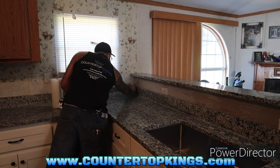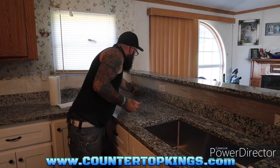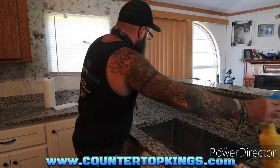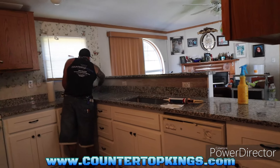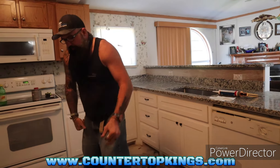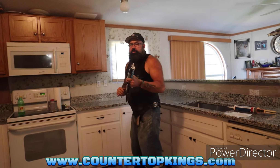You always want to make sure when you're cleaning that you get all the white-out paint off of there before you silicone, preferably. If it gets dry on it, go ahead and spray it again. You want to do a secondary look over and make sure you get all the white little spots and not have any little holes. Now on top of everything I run a bead of paintable caulk in case I want to paint the walls or anything like that.